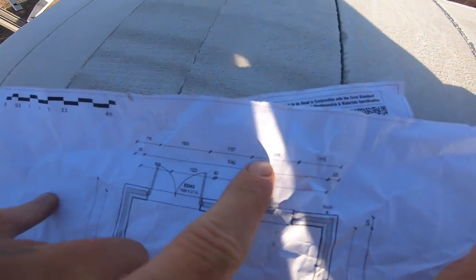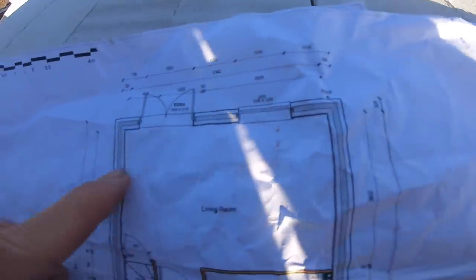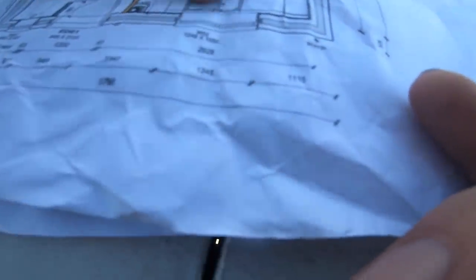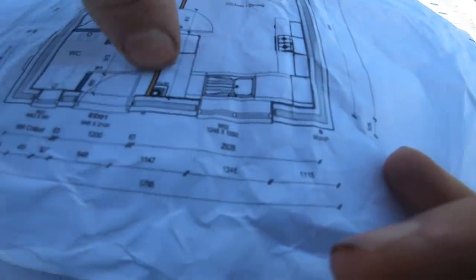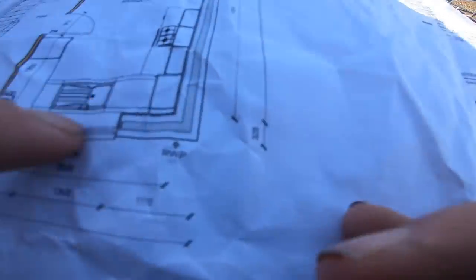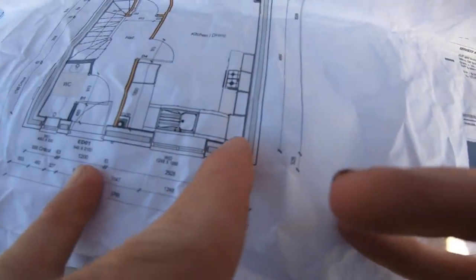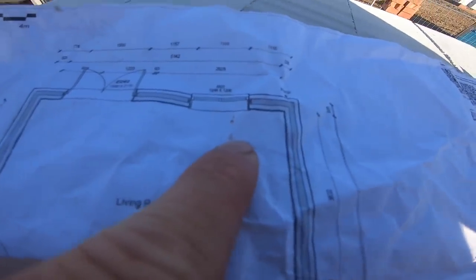See what it's coming up at - you know, you want to shift it just slightly. It's a big living room, so it's like if you're on a kitchen it has to be exact measurements - like a toilet has to be exact. Actually no, a toilet doesn't need to be exact, but you've got to be careful with some kitchens because with the kitchen units, if they're certain sizes - just say this window was put in line with this, then you couldn't go further this way because the kitchen unit would be showing in the window. So you've got to be careful with that. But this sort of window you can move slightly to adjust to the brickwork.